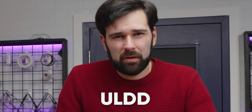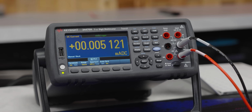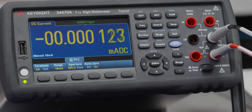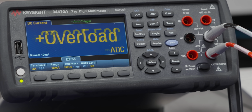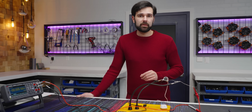These ecobees, they're ultra low draw devices. These draw like 0.005 of a milliamp, which is almost nothing. When we're about to pair them, they're actually drawing a lot of current. They know that they're not paired, and they're drawing 30 to 50 milliamps, and that's kind of what we're seeing when we're dropping down to our 3 volts initially.